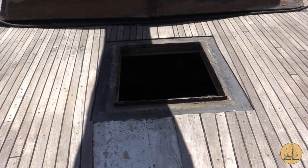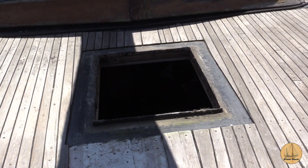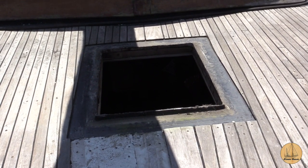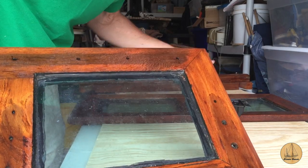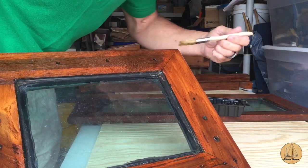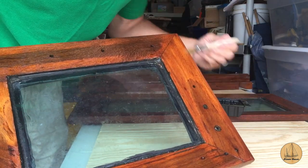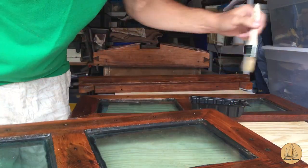The reality is, that frame wasn't even bolted down to the boat. For the second coat, I thin it about 15% paint thinner and 85% varnish, so it's a little bit thicker. The reason is I'm trying not to jump from 25/75 all the way to straight varnish — I'm building up another thin coat that penetrates any places I may have missed on the previous one.